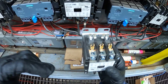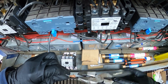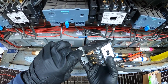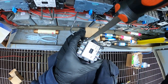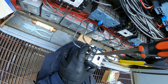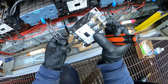These are all flattened out. What I like to do is take my linesman and twist them back together so they can easily fit into the slot. Coil is up here, so this is number one. Stick it in and tighten it down. Our load side is now connected.